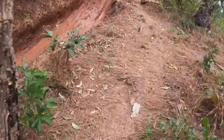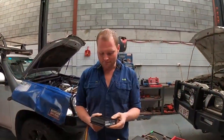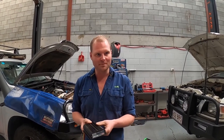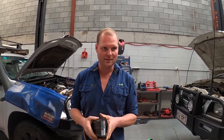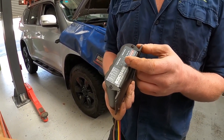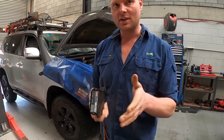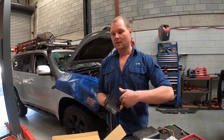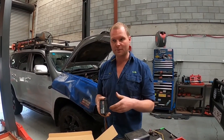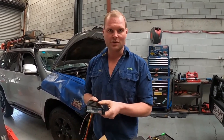It dissipates heat fairly well and is never overloaded. They kind of over-engineer these things to over-perform. Yes, they are expensive. It uses staged battery charging — bulk, float, and absorption — different ways of charging the battery depending on battery status and voltage. It's not just going to keep pumping in bulk all the time. It'll flick over and go to float if the battery is fairly full. That's what you pay for — it's just the quality.